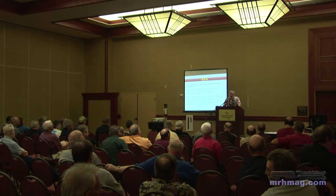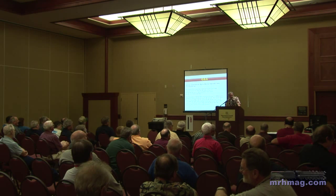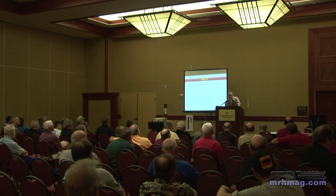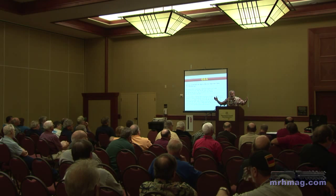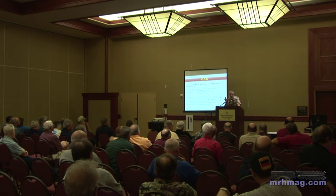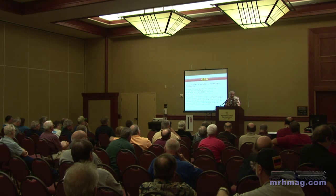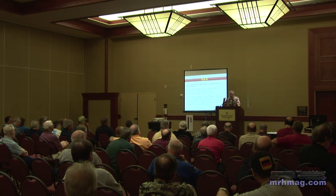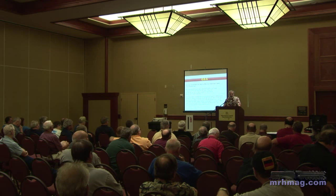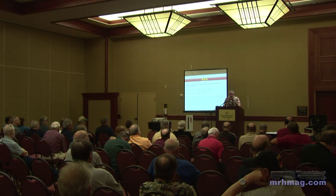The original DH84 with the 9-pin Digitrax connector was designed back around 1995. The reason we designed to those dimensions is that most locomotive manufacturers use the same prints, giving a pretty consistent internal clearance — the DH84 was designed for that width, around 18mm. Bottom line: yes, we know we need a speaker that's much easier to install in the back upper section of a narrow hood diesel. We're hearing you on that.